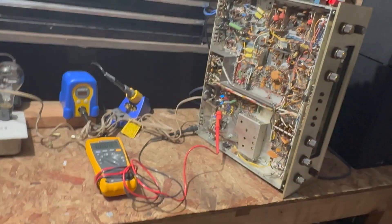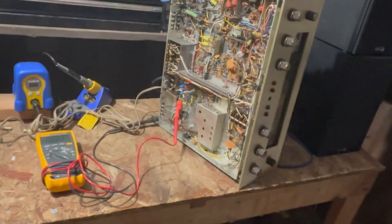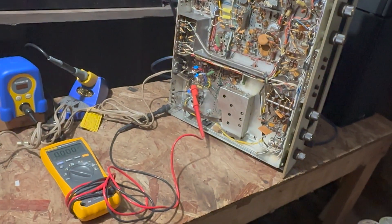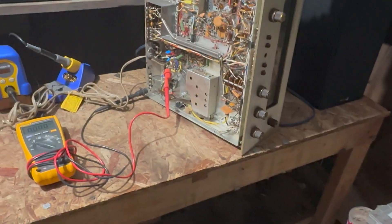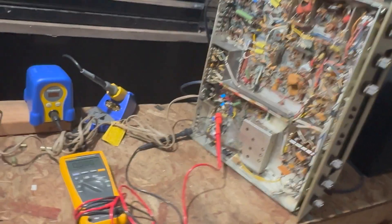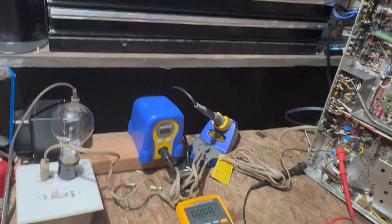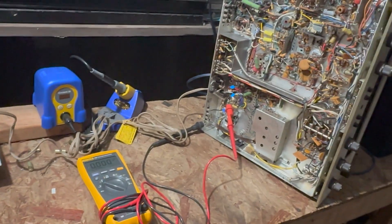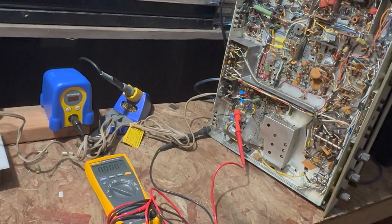This is good. What we need to do now is bring it up without the light bulb and get the full voltage on it. Right now I'm sitting here looking at 110 volts, but realistically the thing's probably only getting 80 or 90 because of the restriction from the light bulb. I just wanted to show that there was no issue — no big short, nothing that's going to completely destroy the unit.